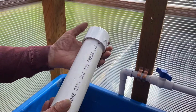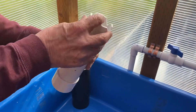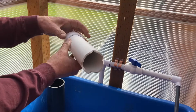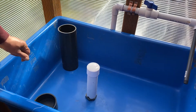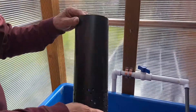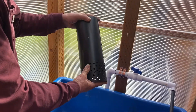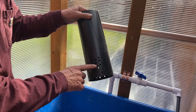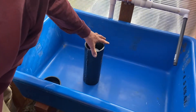There is the bell portion of a bell siphon — it's just a cap on here. You need those grooves just like I did. It's got to fit down on there like so. Now, over the top of that, you've got this 3-inch pipe, and this is going to keep the clay from getting in there. If you don't drill those holes in there, it won't work — I know that because I tried it once and it didn't work. Trust me. Remember the hole. This goes down and that's going to sit right on the bottom.